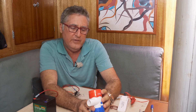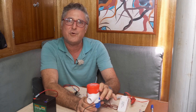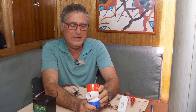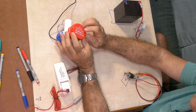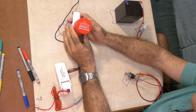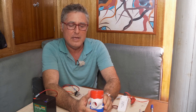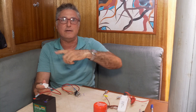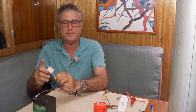The bilge pump itself is one I have in storage — this is what I use on Temptress. It looks really small, but it fits right down into the triangle part of my bilge. I have some massive big bilge pumps that never get used; these little ones do all the work. This particular one is rated for 3.2 amps, and it suggests right on it to use a 5-amp fuse. There's no need to fuse bigger than what your load is, because it'll never draw more power than that unless something goes wrong. And you want to make sure your fuse is not bigger than what the wire could handle in a short circuit situation, so that the fuse blows if things short before the wires do. So we've got ourselves a 5-amp circuit breaker here.